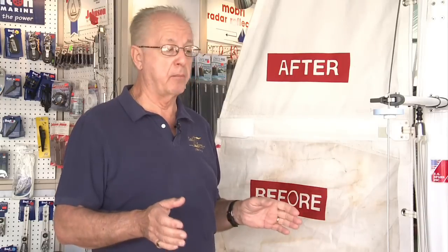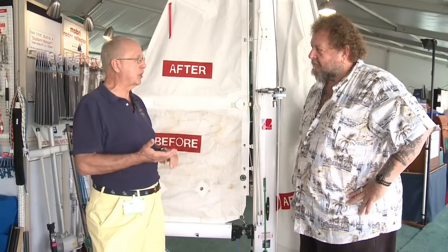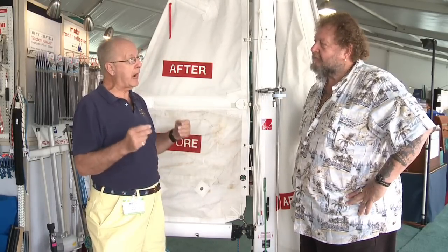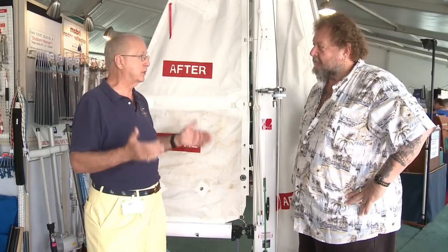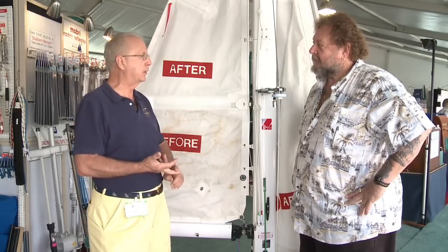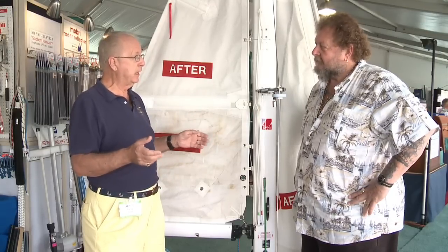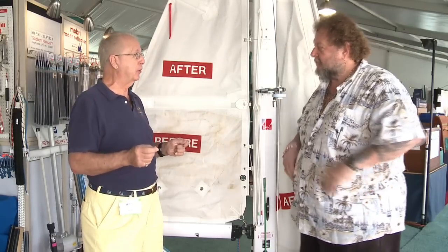We tag each sail and measure it for square footage. An experienced staff — myself included — looks at every sail: the corners, the seams, batten pockets, anything that needs to be adjusted, repaired, or addressed. We itemize everything in a statement, along with the owner's suggestions — full batten conversion, roller furling conversion, taking out extra bag from the bottom, redesigning parts of the sail. We send the estimate invoice to the customer, go over it line item by line item.